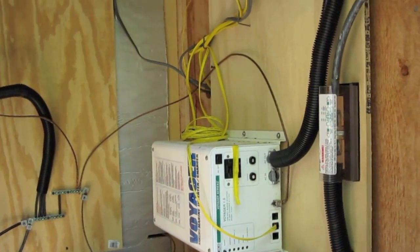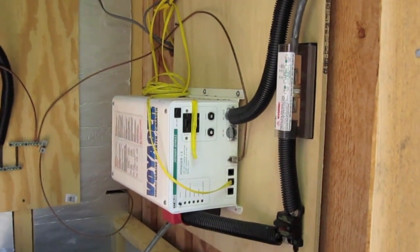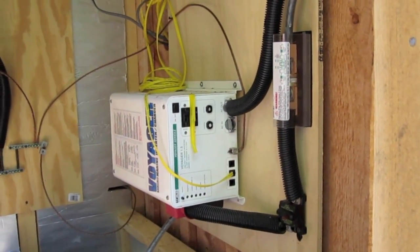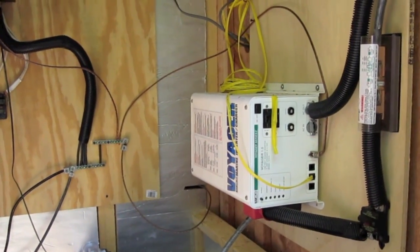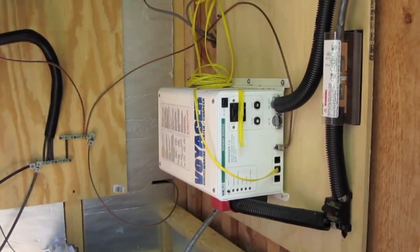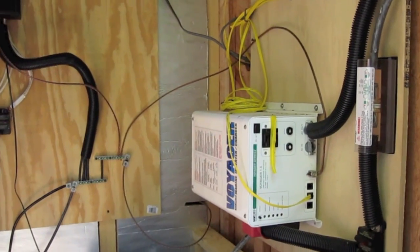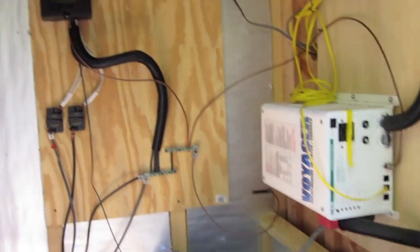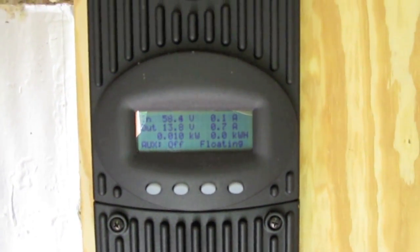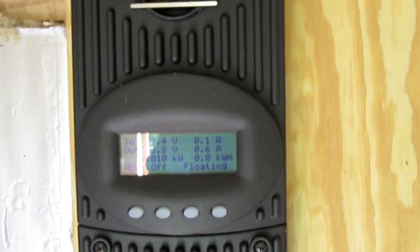Inverter-wise, I could probably get a new 1,000-watt one for about $500 — I paid $350 used for mine. The panels I paid a little over $500 for are down to around $300 now. The drawback to the panels I have is they put out 27 to 28 volts. When I go to add more panels, the selection is slimmer in that size. There are a lot more panels that are the standard 18-volt output, which is what you need to charge 12-volt batteries. Right now I have 58 volts coming in and 13.8 volts coming out, doing only a float charge.